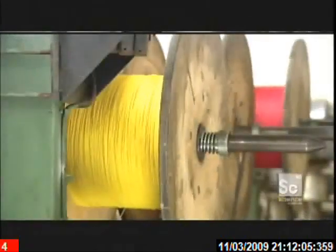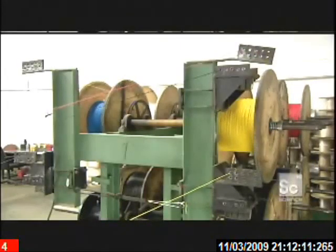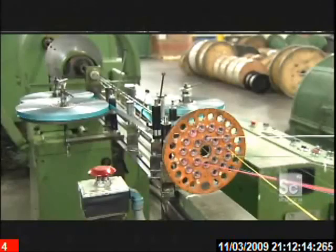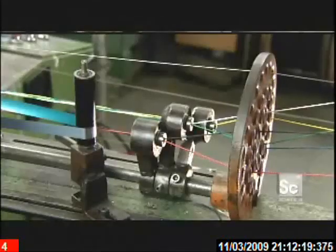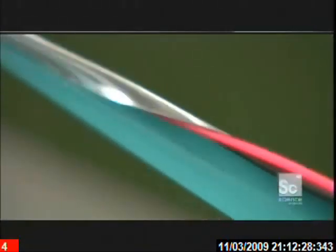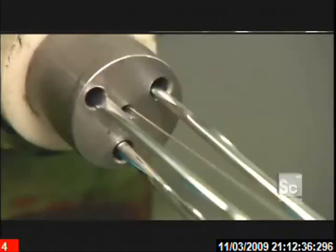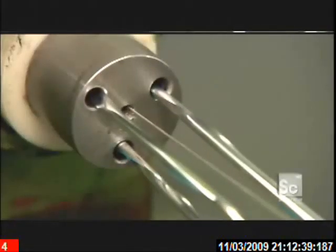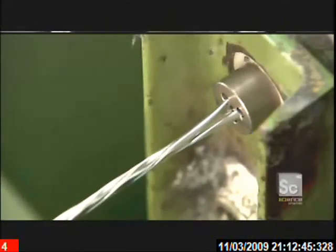This is a different type of cable assembly machine. All the insulated conductors unroll from their reels and travel through the holes of an orientation plate. Dies divide the six conductors into three groups of two, twisting the conductors of each pair together. The machine then wraps each twisted pair in a shield made of aluminum-coated polyester. Shielding eliminates what's known as crosstalk — signals interfering with each other. The next die joins additional wires that don't need to be shielded to the shielded ones, then everything gets twisted into one cable.